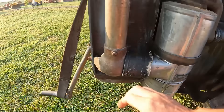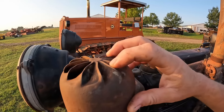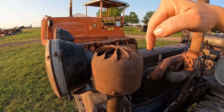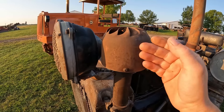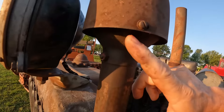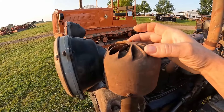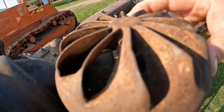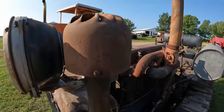All soldered to the tin housing — comes over here, elbows up. We have what looks like a centrifugal-style pre-cleaner: all these fins and slats are punched to direct the incoming air and start it to swirl. Once it swirls inside this air cleaner, the heavier pieces of dirt will be flung out against the inside of the wall and fall out that gap on the bottom before they even enter the air cleaner. Very very hard to find piece right there. There's also a fan down inside of there that spins and helps to pull all that debris out of that pre-cleaner.